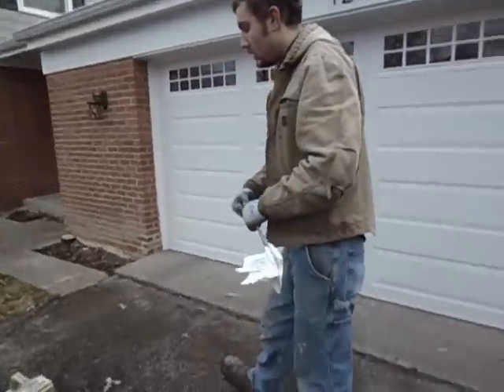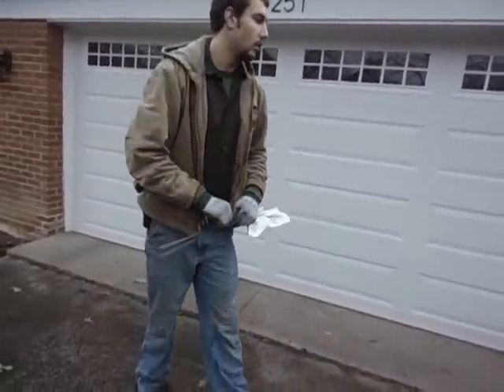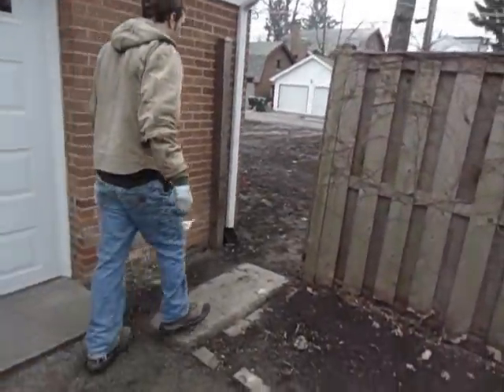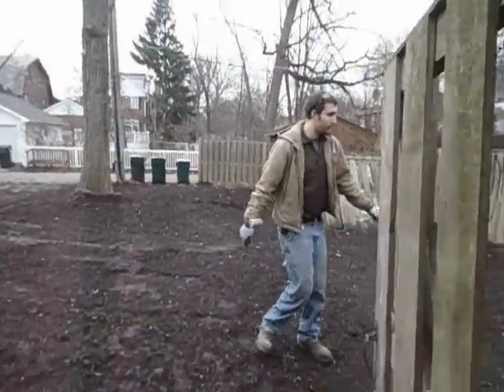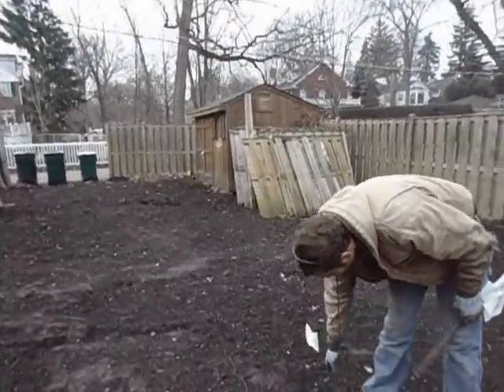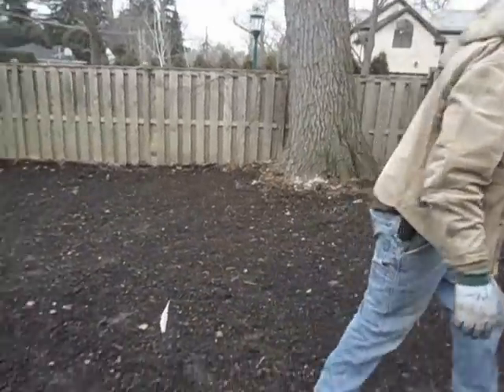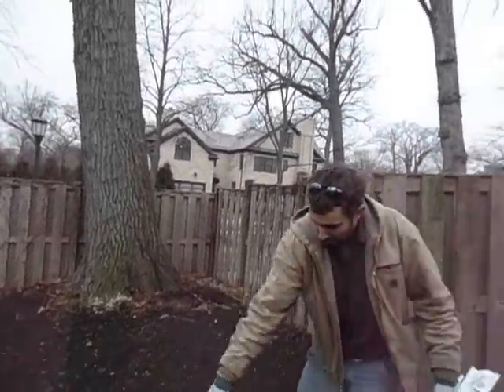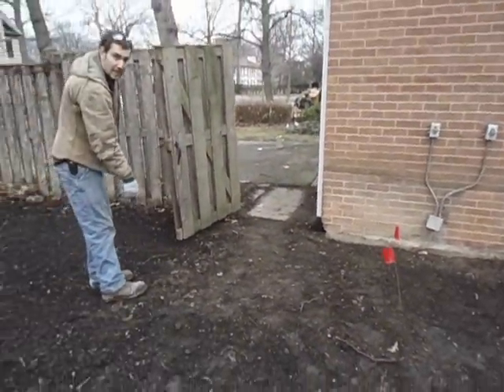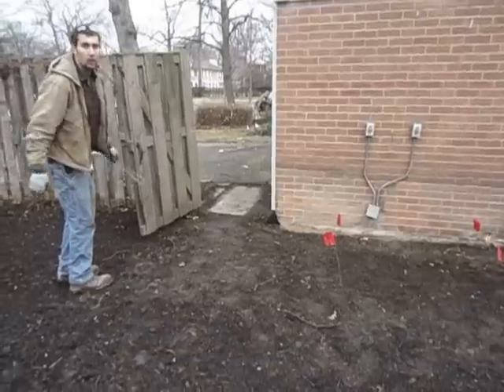So where do you anticipate coming up over here? I'd say... you've got to still come all the way up. Somewhere around there. Then you're going to pull the pipe back through. Then trench it back until we're 18 inches deep, and then swing it around.